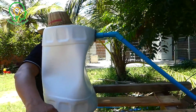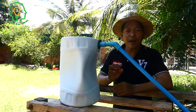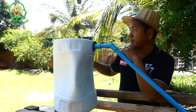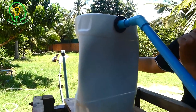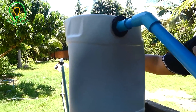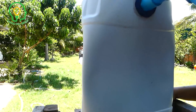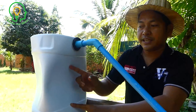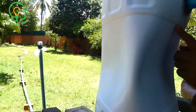Everyone is almost confused that you can just use a short output pipe and it works — it's not. I hope everyone is now clear about the drum pump. The drum pump needs a bigger and longer output water pipe with a vertical pipe to allow air to return back as bubbles. You can hear the water dropping from the intake water pipe — that one is going out, and the intake is replacement water dropping.